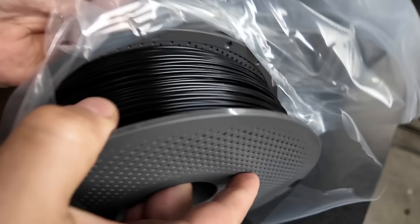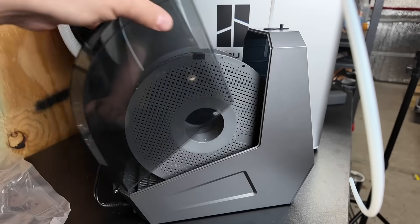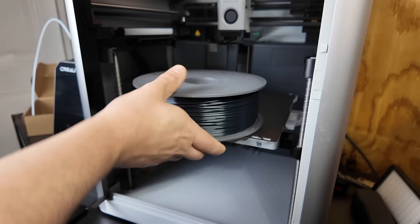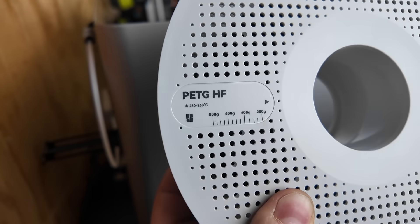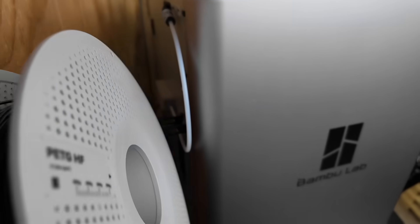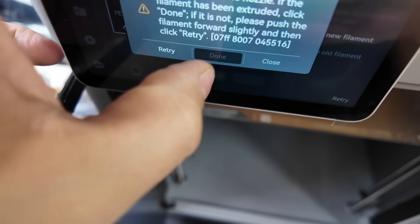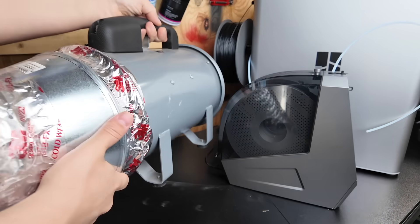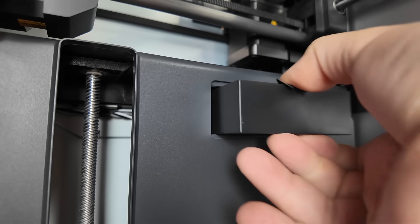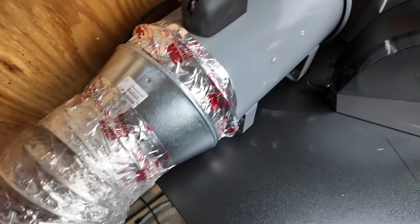Before you start printing, most filaments should be dried to get rid of any moisture from the factory. We typically use a heated dryer, but you could also heat up the filament in the X1C for a few hours. For our first print we'll be using PETG High Flow, which feeds into the extruder and the printer takes care of the rest, even purging excess filament automatically. Make sure you also have proper ventilation — the X1C includes a filter but we also use a fume extractor for extra protection.